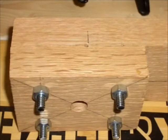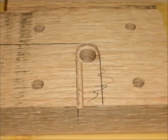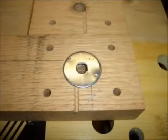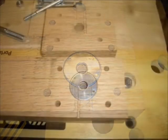You can see the small diameter hole at the top of the jig. This is the hole into which the wire will feed, and then the wire will wrap around the 3/8-inch diameter steel rod. There you can see the 1/8-inch diameter hole. I then countersunk and installed a steel fender washer in the back part of the jig. The purpose of this washer is to force the wire to come out the front of the jig as it coils around the steel rod.